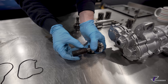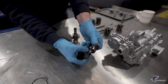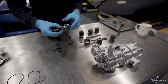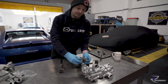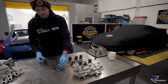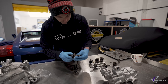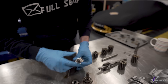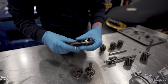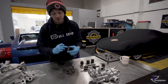It's just a more complicated system because you have these joiners - couplers. This one was brand new when we rebuilt the engine and it's already started to corrode. They literally rot in place - we battled getting it off. That corrosion grows at the shaft and you can see where the lip seal has been running - that's where they start to leak. Then there's another coupler and a long shaft into the back of the water pump and thermostat housing. These are a nightmare because they seize solid - they're circlipped on and we've had to cut them down the length to release them.